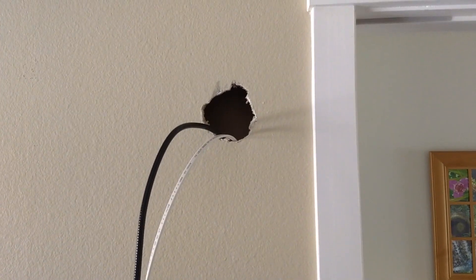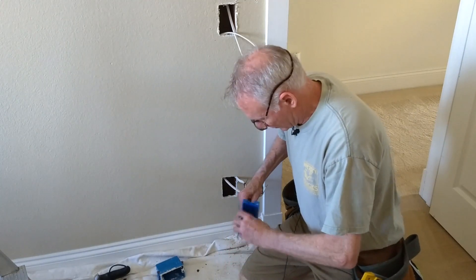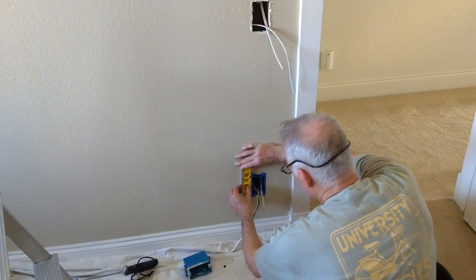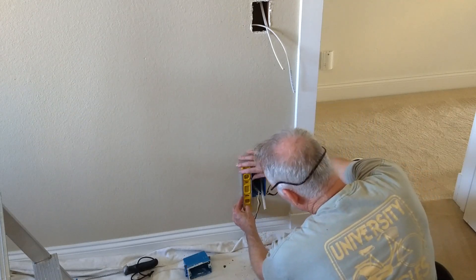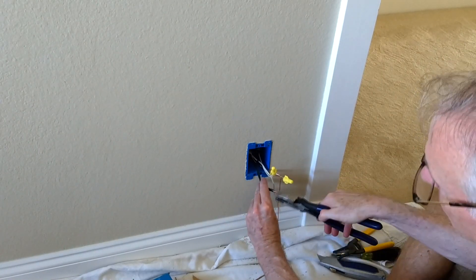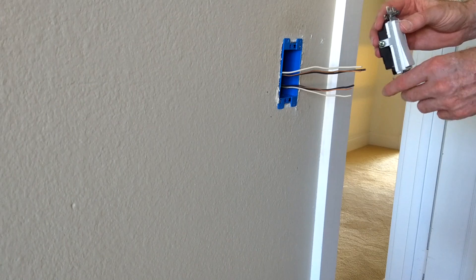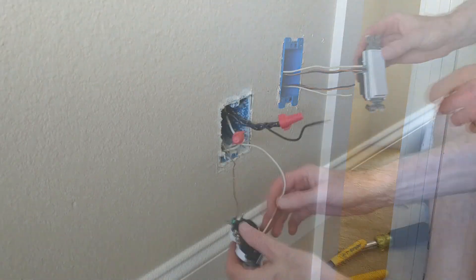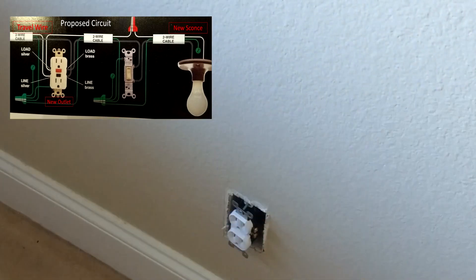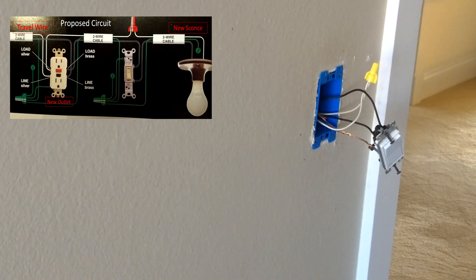Now I've got a wire from the sconce opening down through and into the switch box. Once we overcame the fire blocking and got all the wires pulled, the job turns to feeding wires into the remodeled junction boxes. I inserted the boxes into the wall making sure they're plumb, then tied the white neutral wires together, adding a pigtail for the new outlet, as well as the black wires, and connected the outlet to the proper wires. Back at the switch box, I tie the neutral wires together and insert the switch to break continuity for the black wires. At the old switched outlet, we alter the circuit to match our proposed diagram, supplying power to the new wall outlet, then power travels up to the wall switch which controls the wall sconce.